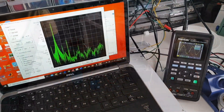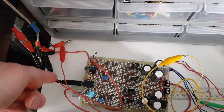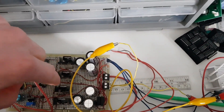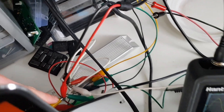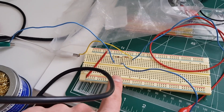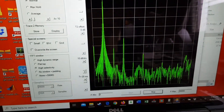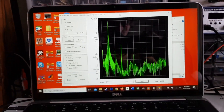This is my setup for measuring distortion. I have the incoming signal from a signal generator at 2 kHz running into one of the channels, into an 8-ohm dummy load resistor, into an oscilloscope to see the waveform, and a resistor-divider attenuator going into a laptop running a fast Fourier transform display.